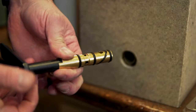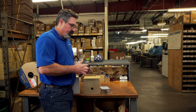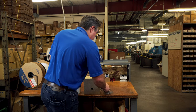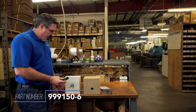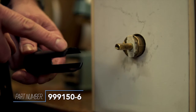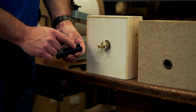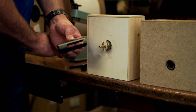That's what makes this the premier extractor for the 1200 and 1225. Up until now we have not had a solution for the PosiTemp. That is where our new part, the PosiTemp sleeve, part number 999150-6, comes into play. We have machined this with two divots to sit on the valve bodies that have the ears. If it doesn't have the ears, it'll still work. We have slotted the sleeve on both sides to allow the PosiTemp cartridge to ride inside there.